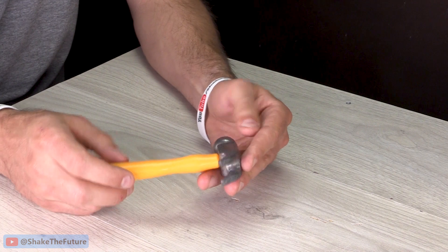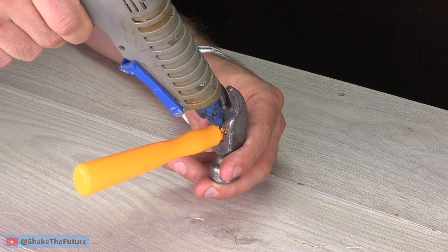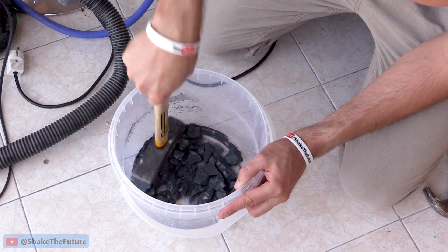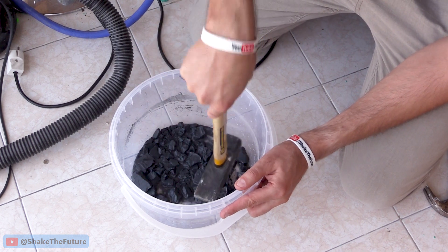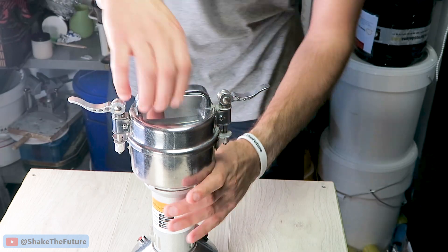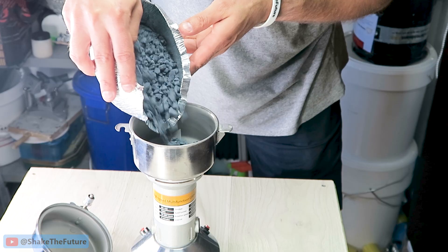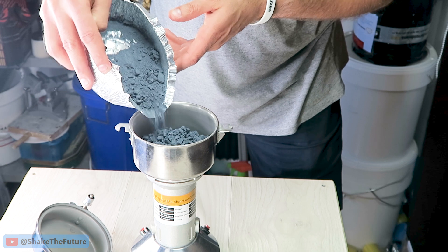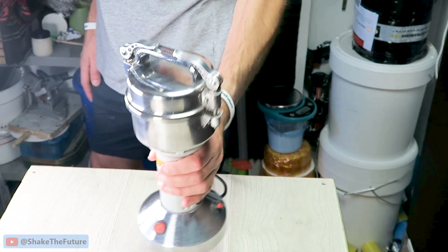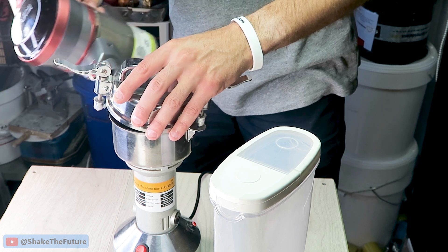It's time to prepare the hammer so we can cast the handle. I used a little bit of hot glue to fill the gaps. I smashed the silicon carbide into smaller pieces and also changed the water a few times, then dried it in an air fryer. A cereal grinder is a pretty good low-budget option to grind silicon carbide. Of course blades will not last forever and you will contaminate silicon carbide with some metal, but it came with two or three sets of blades and they are replaceable.